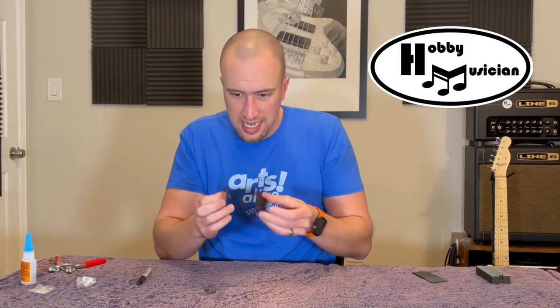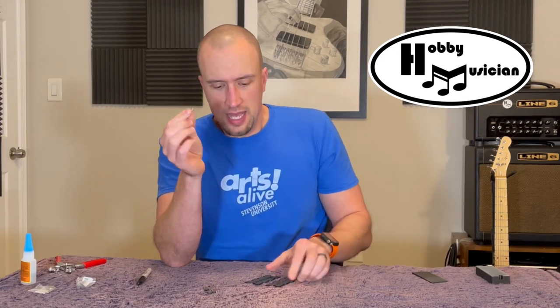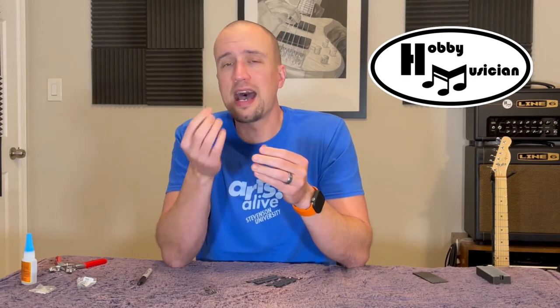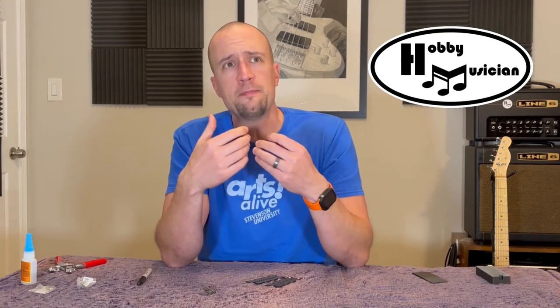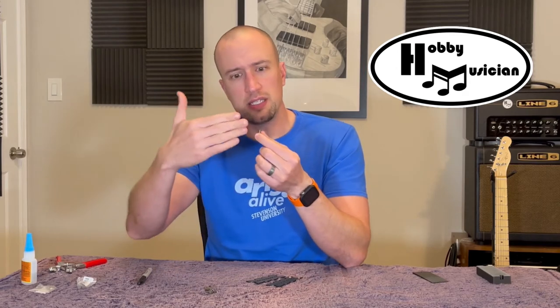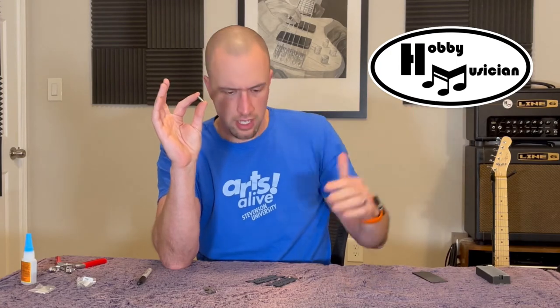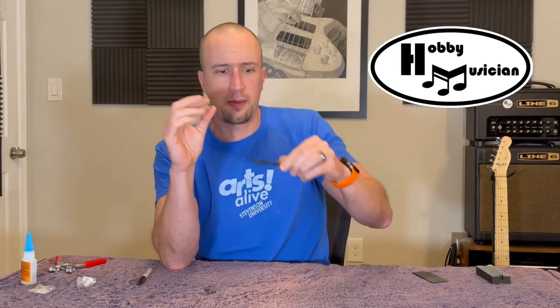What we're going to do is insert the magnets into each of the holes and then sandwich the two bobbins by pushing the magnets all the way through. Here's a hot tip for working with these: if you look into building your own pickups, you'll very quickly find it's very important to make sure the polarities — the north and south poles — of your magnets are all aligned. When we make this pickup, we want to make sure all the same ends are pointing up or all pointing down.